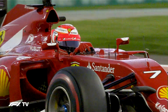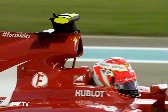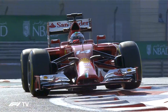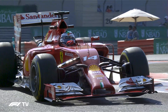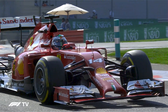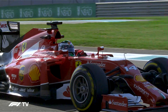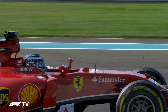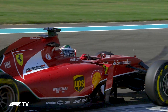Honda initially lacked pre-chamber ignition as well. Everyone now has pre-chamber — turbulent jet ignition as Ferrari calls it — which is the Mahle technology that Ferrari still uses and is now starting to appear on road cars. If we could all have 30% better fuel consumption while keeping the same power, we would have it. Ferrari had a lot of catching up to do, and it really has taken this entire era of the sport for everyone to get very close on power unit performance.